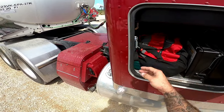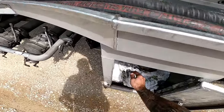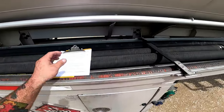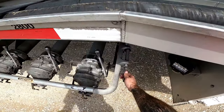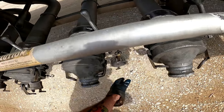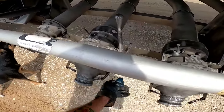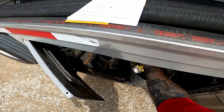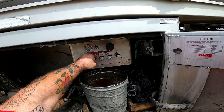My way to turn the pump on is right here in my sleeper door, so I automatically go ahead and open up my sleeper door. Then I come down here with my bare hands and grab my gloves. I'm very picky about touching the trailer with my gloves on — I don't want stuff to get all dirty. I like to grab my bar right here without my gloves on, open it up, then throw my gloves on and start getting my caps off. I loaded every compartment with diesel so the trailer can be flushed out in case I get a preload of oil tomorrow. We'll pull all the caps off, open the trailer up — bare hands on my door, on my buttons, pulling my valves out. You got air valves, your master that opens up all the vents, and then all your belly valves — pull them open.